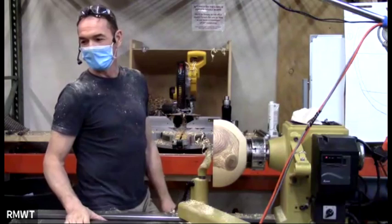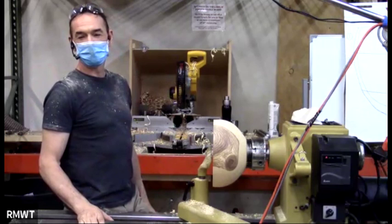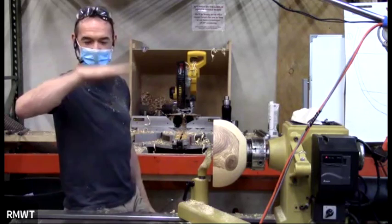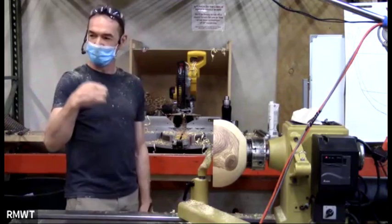They tilt the skew on its side, the chisel on its side, not the scraper. So what's that called? It isn't shear scraping. It's negative rake scraping. It's a form of negative rake. You took the plane that the bevel is running parallel to and altered it. That's negative rake trailing the burr. That's why it doesn't grab. But the problem is you've got to keep it balanced while swinging on an edge, setting on the corner of a tool. Hence, negative rake scraping.